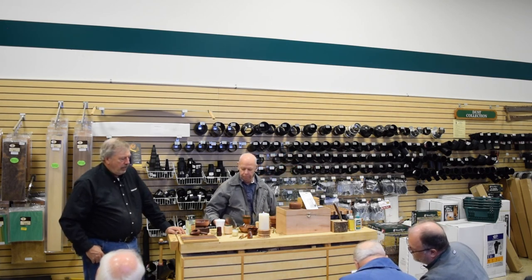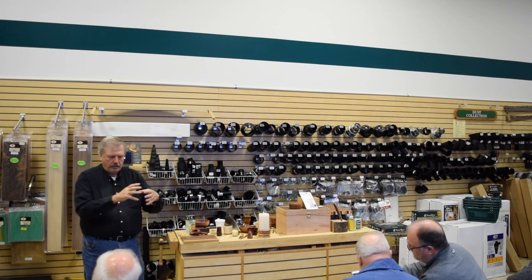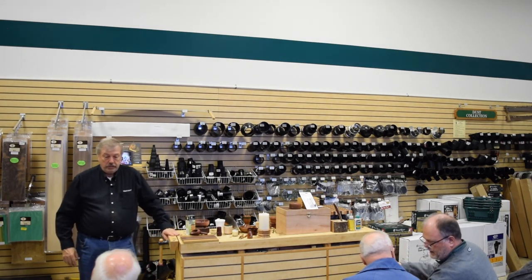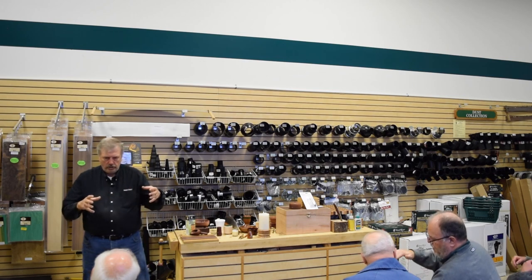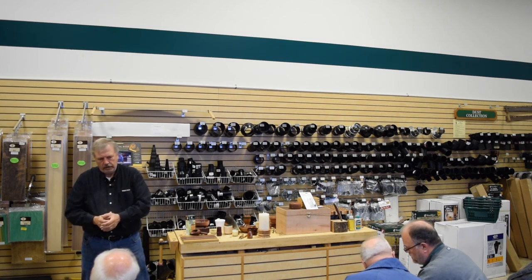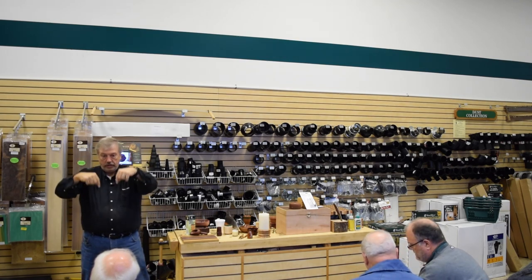I've made those before, and again, that's a lathe. That's a technical lathe one, because now you're trying to fit that container, and most people think it's technical down here. No, it's right at that lip, getting that lip inside the underside of that container. It's not hard to do, it's just very technical. So what you're doing is, when I did it, you turn the outside first before you do anything else. And then I've got that little lip, and I fit it in here, take a little off, fit it in here, take a little. Once I get that all done, then I do everything else, knowing that that's going to come this way inside, because that's the way that the drink thing is inside.